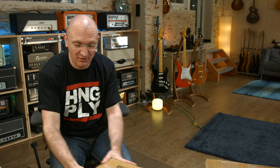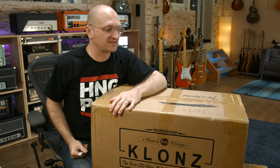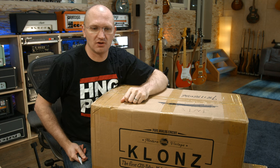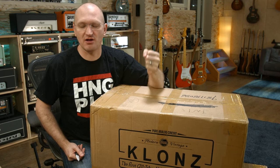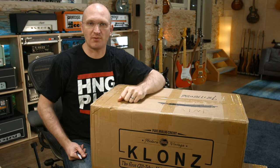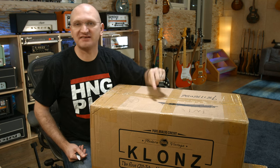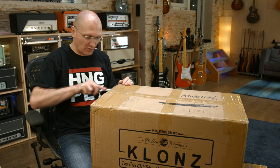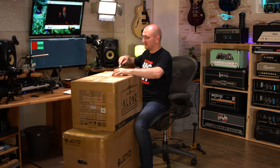I was curious and I fought very hard to get you everything you need to make this really cool — which means footswitch included and hopefully the tube kit included. We're gonna see. With an amp that gets delivered with 6L6s when it also offers circuits based on Marshall or Voxy-kind circuits, it only makes sense if you actually put EL34s or EL84s in the power amp. If you want the fat California sound you need 6L6s. The amp can take any kind of tube, but it makes sense to include them, so I fought very hard for those to actually be part of how the amp gets delivered.